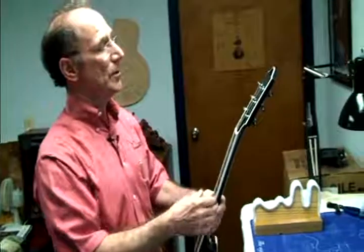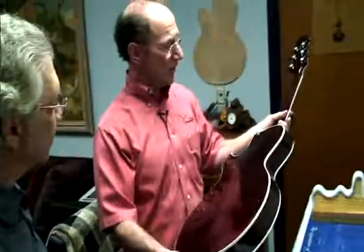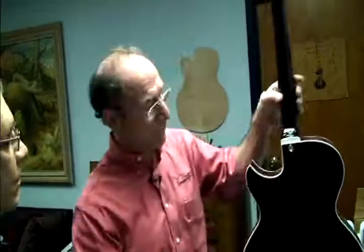So if there are any, now's the time. We hope that we've prevented it by now. Now, if you did find a defect in the finish, what would happen? Well, if I did find something, it would only be something very, very minor, or it could never have made it this far. Let's say there's a little speck of dust on that white binding, a little black piece of dust would show up. What we would do is get in there and remove that speck, and then we would drop fill the hole that's left. We would put a little bit of lacquer in that hole. When the lacquer dries, we would level it out and polish it.